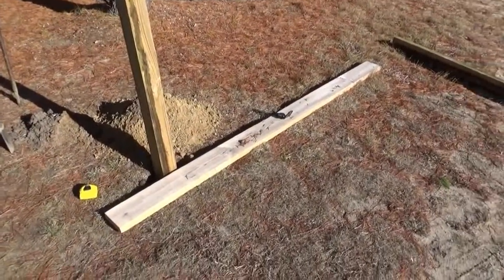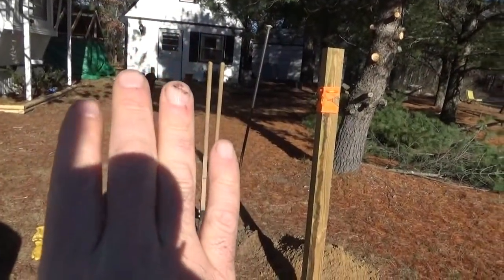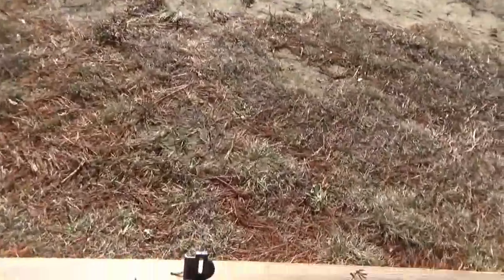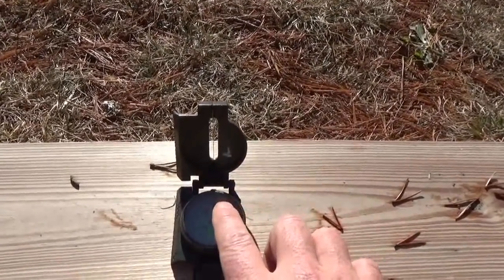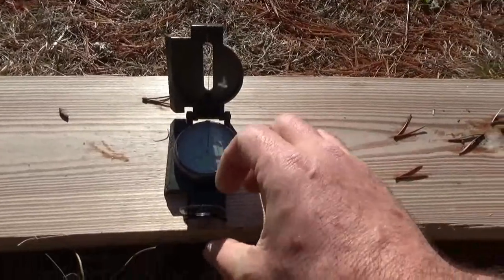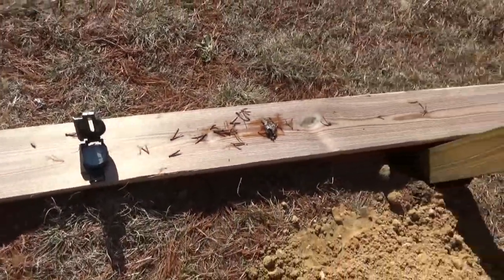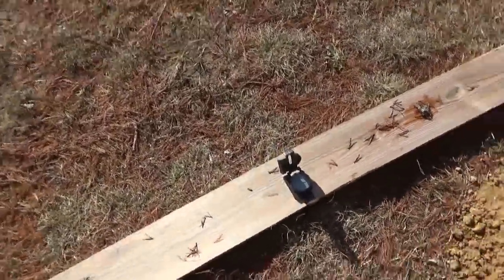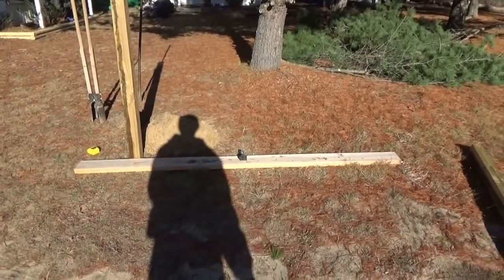Something else I'm doing — I'm looking at due south. I was going to line up the solar panels with the house, since everything faces at a certain angle straight toward the yard. But for optimum solar power production, I want to face due south, which is this direction — and that's not exactly where I had thought. So I'm setting a board on the ground and placing the compass perpendicular to it, adjusting for due south, so I know one post is here and the other post will be right along due south. That way I'll get my angle right. What I don't like is how that's going to look with the house, but maximum solar power production is most important.